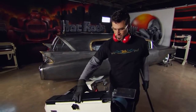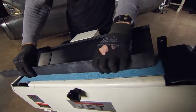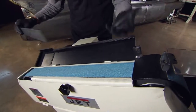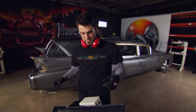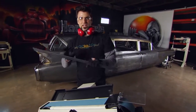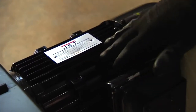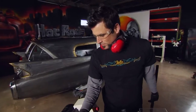What they really do well is they've got a nice long belt so you can put big long surfaces on here. Say you get something water jet cut, plasma jet cut — you want to go back and give it a nice, even, chamfered line in one direction. This one is single phase 230, which is great. Real nice operation.